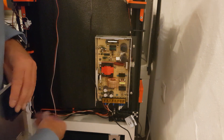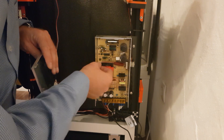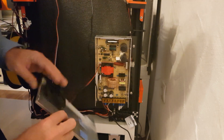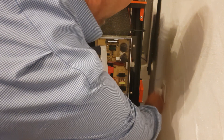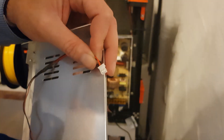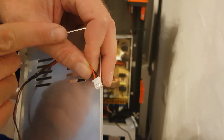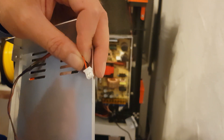The new fan is now mounted. I'll connect it now and check whether it spins and whether I haven't reversed the polarity. The fan didn't spin initially. I used a scalpel to press down the locking tabs and pull the cables out from the back, then simply swapped the cables — black to red and red to black. I'll plug it back in and see if it spins now.